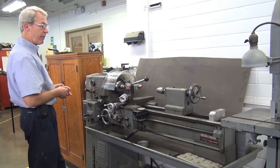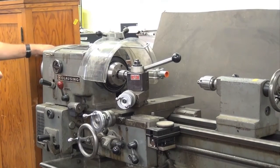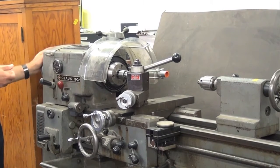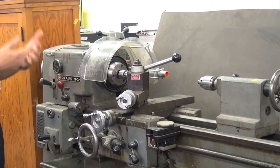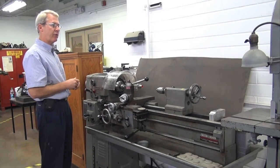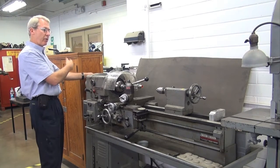Other things that rotate on a lathe, you certainly want to be looking at that. The back side of this has a handle and basically a rotating wheel where inadvertent contact could possibly cause some damage and harm to you — it also could be an entanglement hazard. You have rotating wheels, rotating shafts, a lead screw, and an entanglement hazard meaning you could get drawn in — hair, clothing, this kind of thing. You also have shop rules that will address that from an administrative standpoint. However, machine guarding — the actual physical guarding — is still the most effective way to control that. So some kind of a cover on top of this, it could flip up or be easily removable, that would prevent contact or entanglement with that.